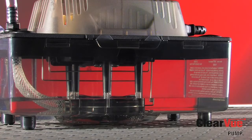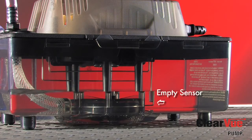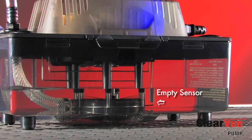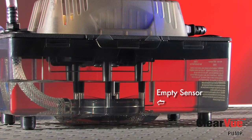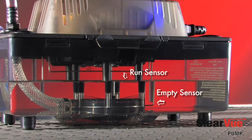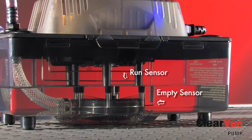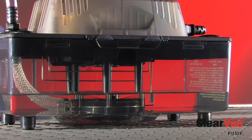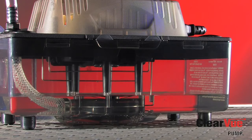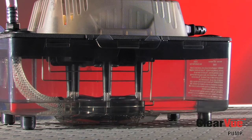As you can see, water is coming into the tank and it's touching that empty sensor — the bottom sensor. This sensor lets Clearview know that there's water in the tank. Water will continue to rise until it touches the run sensor. The run sensor uses what we call our IQ technology, which are the brains behind the pump. These brains determine how fast to run the motor to remove the condensate. So Clearview will slowly ramp up the pump speed, which gives you quiet operation as compared to full throttle mode.